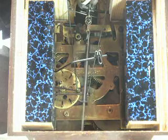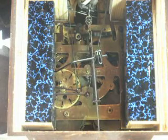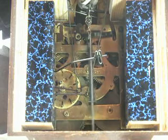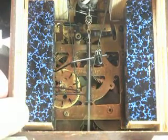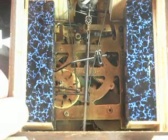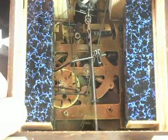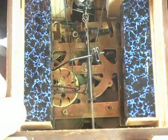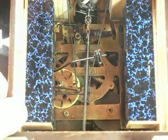Right now the clock is pretty much on what I call a sweet spot, or other people call it in time. Now when you cock the clock to one side, this one has a really small sweet spot. You'll hear the clicking, ticking change. Hear that? Tick, tick, tick, tick. It's out of time. Put it down.